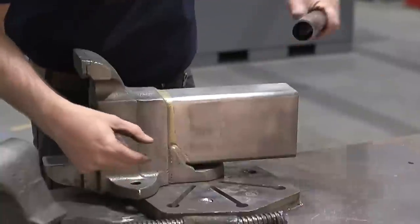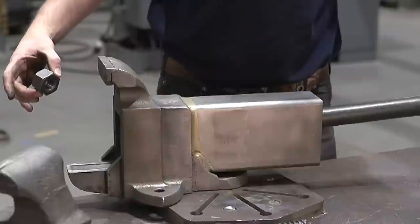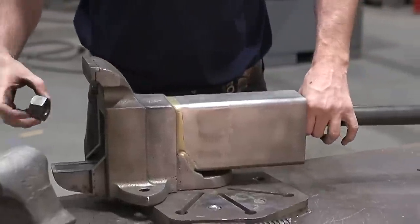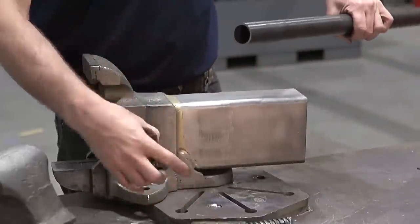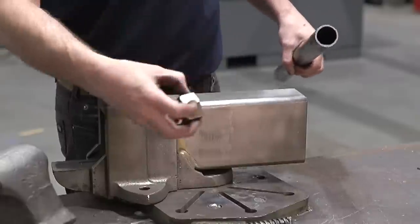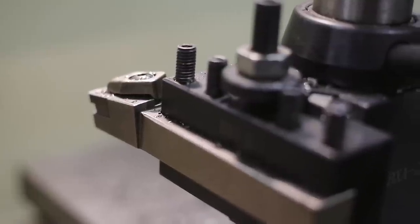So since we did away with that nut that was in the middle of the body, we need to add the nut back into here again. So I'm going to extend the nut from the back of this tube to the middle where this one previously existed, and then we're going to add in some nuts and weld them to this extension. So let's build this extension tube and all the parts to fit to the tail.